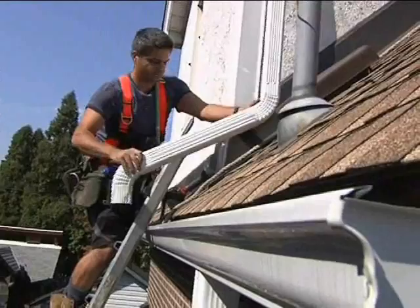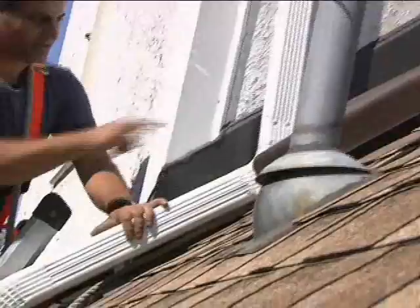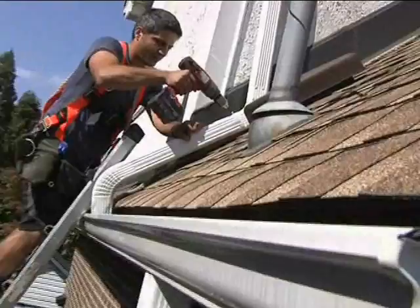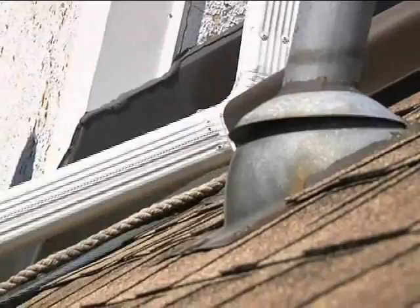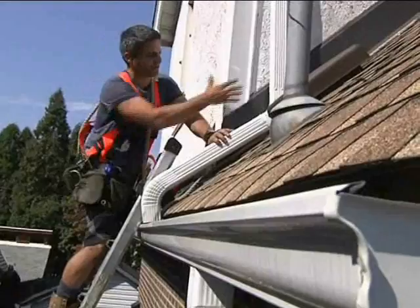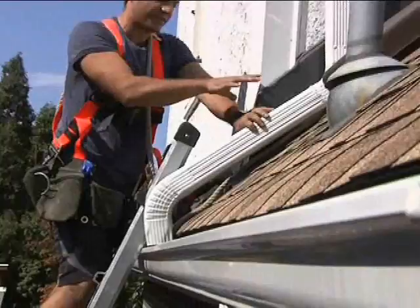I've already pre-made the piece here — this is the unit. We're going to attach it with the elbow pointing down, very important. We're going to guide it in here — it's mainly an issue of controlling the discharge. Bring it up against the building. Now you've got the water following in a continuous path, going into the eavestrough and leaving. The way we fasten this, we use special screws. Make sure to at least secure the two sides. Don't ever secure it at the bottom — you don't want a hole in the bottom. You want it at the sides and at the top. So we're going to pop the screws in here.